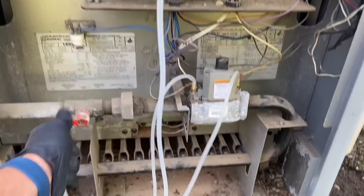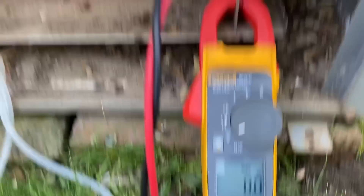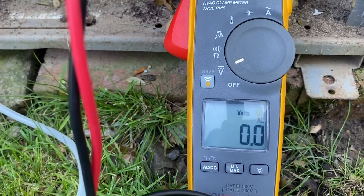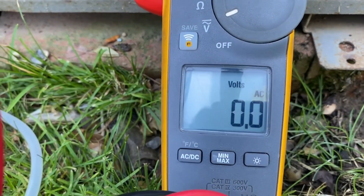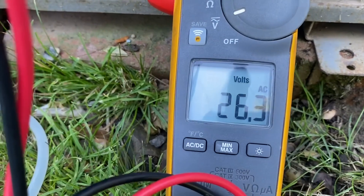Bad valve. But before I actually condemn that 100%, let's turn off the gas and get a voltmeter on here to see if we're really getting 24 volts. There's my voltmeter — two leads from the gas valve. We're not going to hear a click because the gas valve is not wired anymore, but we're waiting to get 24 volts. 26 volts. So we have a defective gas valve. When we checked the outlet pressure, we didn't really get much — it wasn't letting out gas across the gas valve.